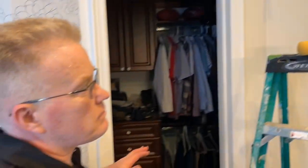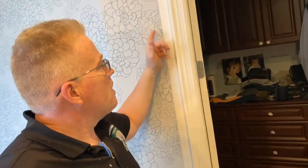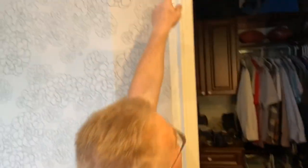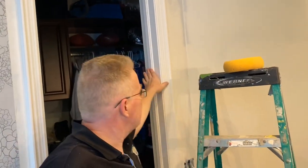And if I were doing a whole room, I could hold that sheet and meet it up to a left piece. Now here, so this is my right edge, I'm going to need a left strip. So I won't have a left strip over there, but if you're hanging an entire room, just cut this just below the horizontal piece and fill it in later. I'm going to do that because I'm going to take a strip of wallpaper from this left strip and I'm going to use it here. I'm not going to waste a whole sheet of wallpaper. I'll show you what I mean.